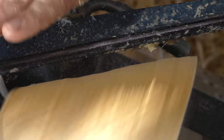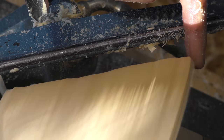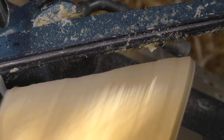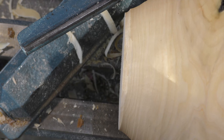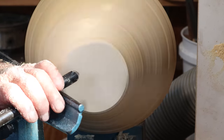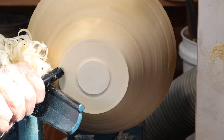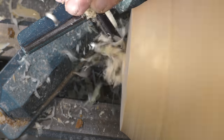Now if you're roughing down, that's probably all you need to do, and then you just need to trim up the edge or come in just to take the ragged corner away, because it's a bit dangerous — it gets very sharp. I'm going to use the left wing and just pull that in on the base. I'm going to use the long left wing tool right on its side with the hand on the rest, basically squeeze the edge in, then roll the tool over and get the bevel rubbing for a shear cut back towards centre.